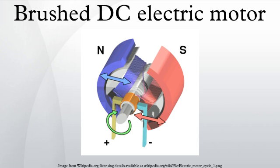Since DC motor field loss can cause a hazardous runaway or overspeed condition, loss of field relays are connected in parallel with the motor's field to sense field current. When the field current decreases below a set point, the relay will de-energize the motor's armature. A locked rotor condition prevents a motor from accelerating after its starting sequence has been initiated. Distance relays protect motors from locked rotor faults.